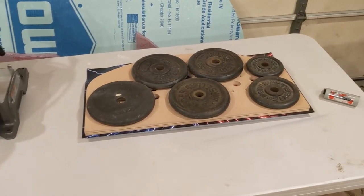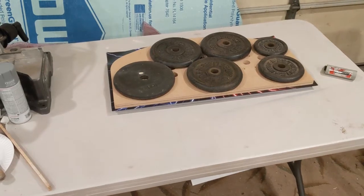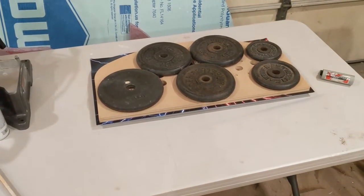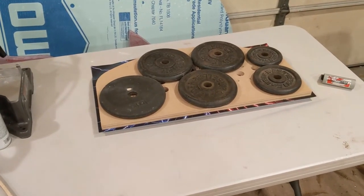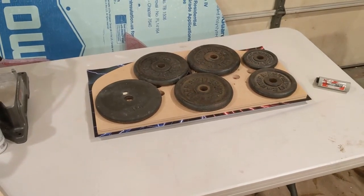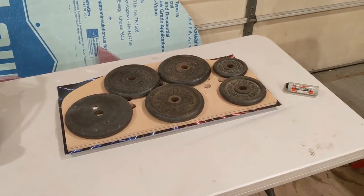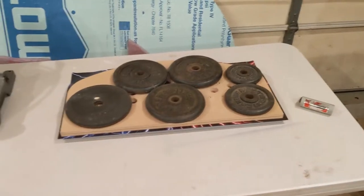I coated the control panel with automotive primer after sanding it smooth to about 220, then painted it with a primer and sanded it with 400. I actually found a high spot because one of the inserts needed to be backed out about one turn, maybe a turn and a half, then sanded it all down and got it like glass. Cleaned it off with tack cloth to make sure there's no dust, then squeegeed the control panel overlay on to make sure there's no air bubbles. Just give it a couple hours to stick really good and we'll get back to it.